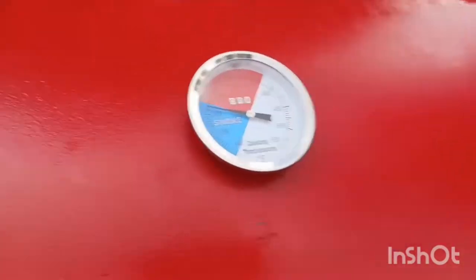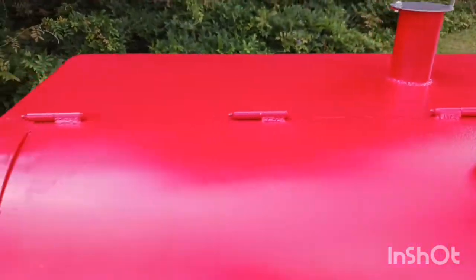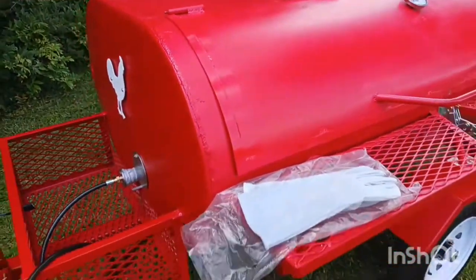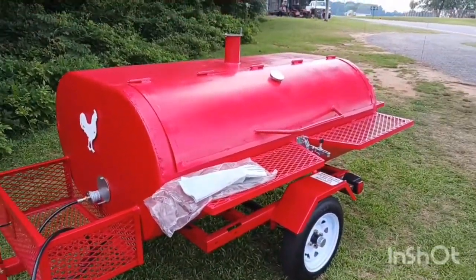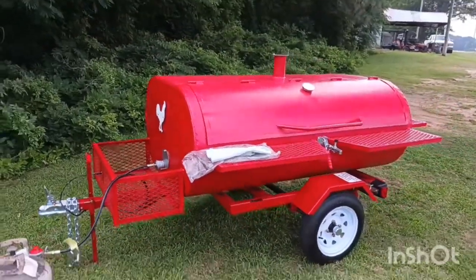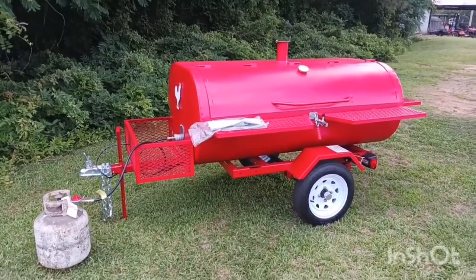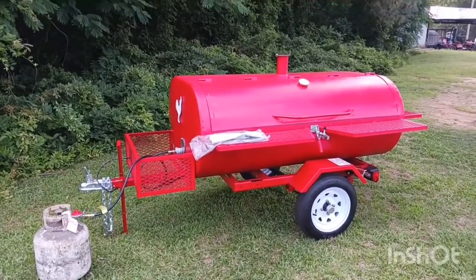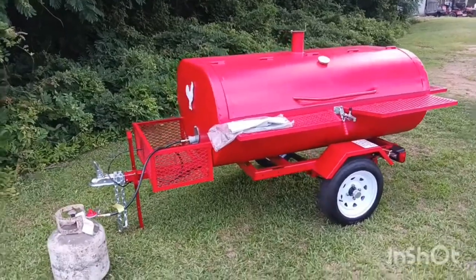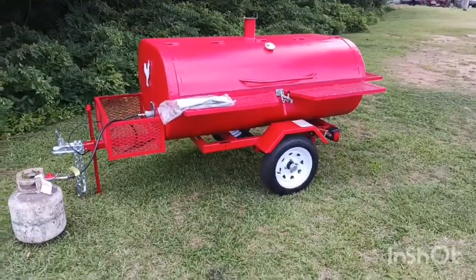When you get a lot of meat on it — a big pig or something — you can adjust some air right here and let it pull through the bottom. We'll crank it up right quick and let some gas get to it. You can hear it making a hissing sound. See, it's already climbing to 200. You can come out here and turn it back in and fine-tune it where it just barely makes a hissing sound. Just wait, give it about five or ten minutes and let it get ready. That's as easy as it is — once everything's set right and the burner's burning good and blue, you're ready to go.